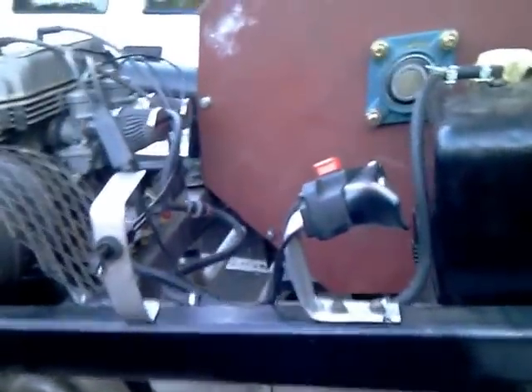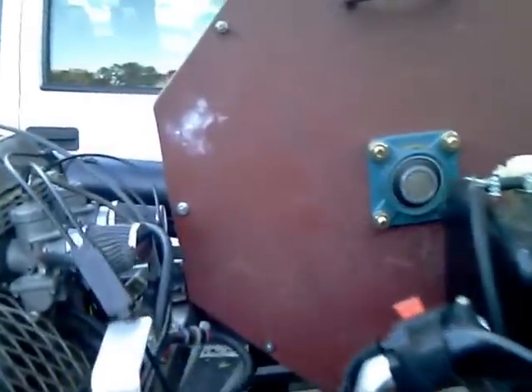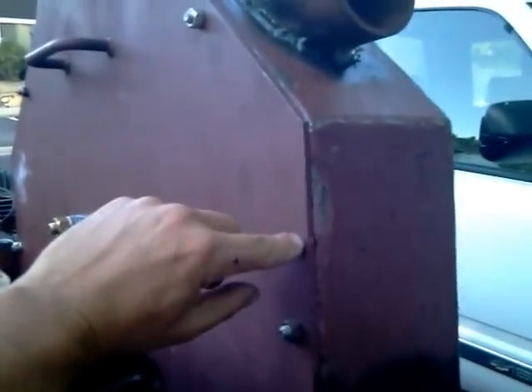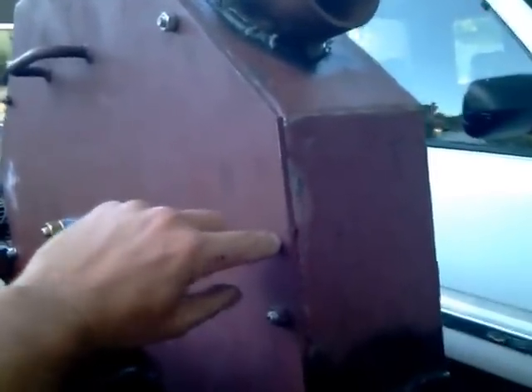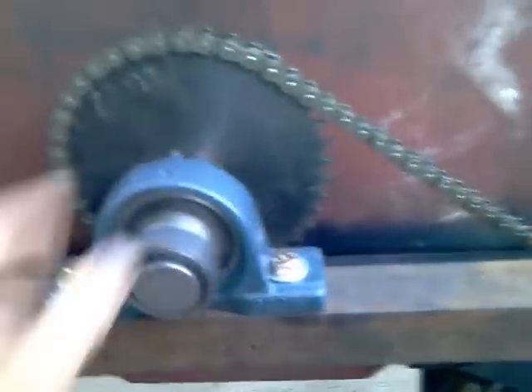It's got three bearings. I'll post another video when it's all ready to run. It clanks around right now because the internals — I measured perfectly, but when we welded some of it, it shrunk the frame in a little bit when we welded the wear plates inside. So there was a 32nd of an inch clearance, and now in one spot there's zero clearance.